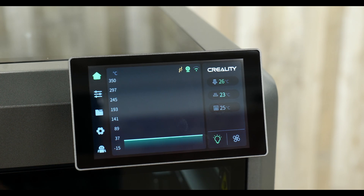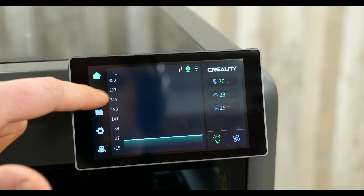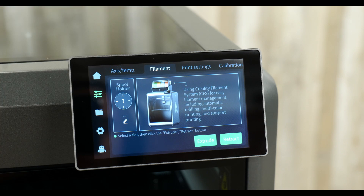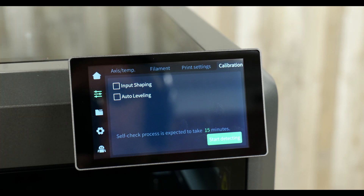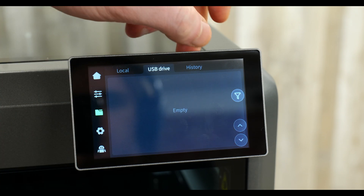I'm going to leave the chamber at 25. Over here is your light — you can turn it on and off — and right over here is your fan. Going to the options tab, you've seen this before for making your adjustments. What's new is this 'E' button, which lets you extrude filament from the printer. There's also a filament button — if you have the CFS attached, you can extrude or retract filament from there. The spool holder option lets you choose which filament you have loaded. Under print settings, you'll find all the AI features. Under calibration, that's where you redo your input shaping — if you move your printer to a different surface, always do an input shaping and an auto leveling. Right here is where your local files are stored, your USB drive, and your print history.